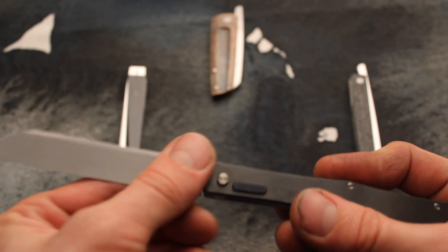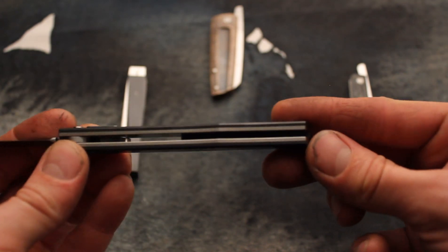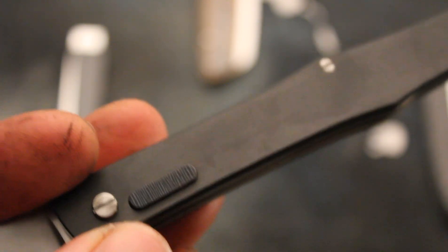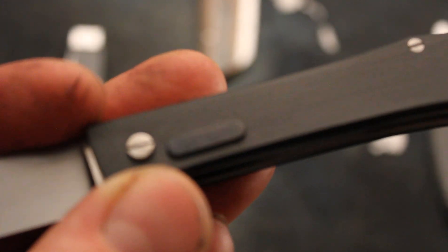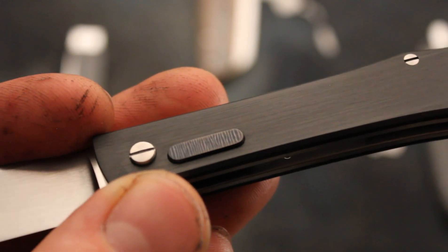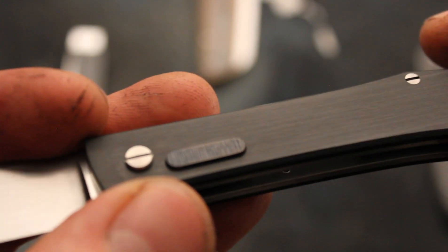The hollow ground is made on a 40 centimeter diameter contact wheel. There you can see the inlets, and I put that idea of the slots with ceramic detent balls with a hidden setup, so you cannot see the cutouts like on the previous folders. One more special thing — it's not so visible because I put a black finish on this time, but the buttons are laminated on both sides.